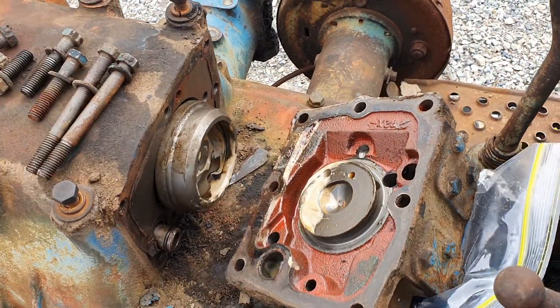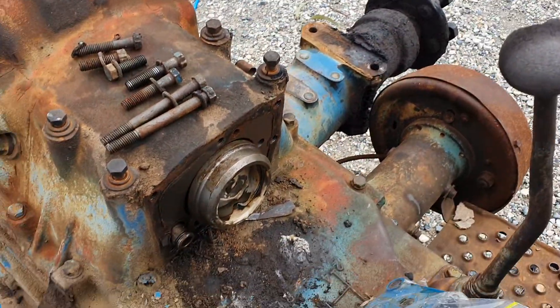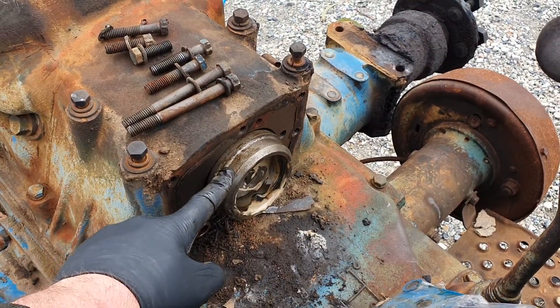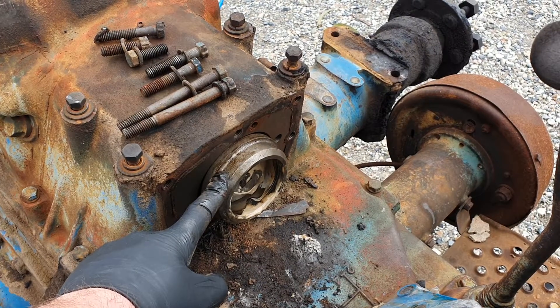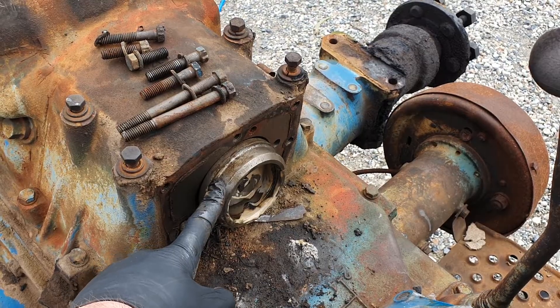You're going to pull that off. As you can see, the gasket's gone and the oil is that horrible milky colour. You've got your main hydraulic control cylinder, and this is what provides the raising and lifting power as part of the hydraulic system.